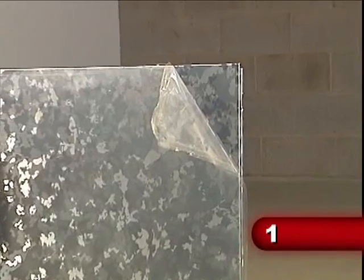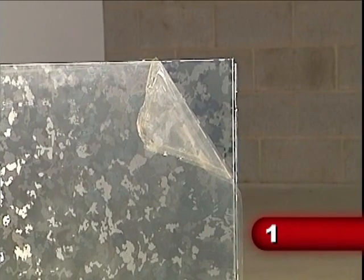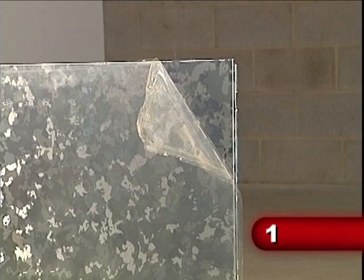High-sheen panels may also be coated with a plastic film to prevent smudging. The corners of the plastic film should be peeled back slightly to allow for easy removal after the panels have been installed. Celebration is installed into regular 1/4 inch DXF fine-line ceiling grid. Standard fine-line grid is white, but a black reveal is also an option.